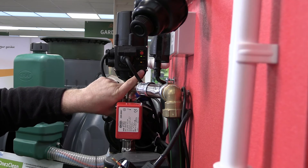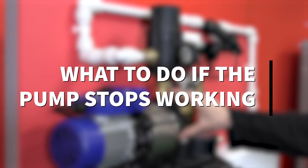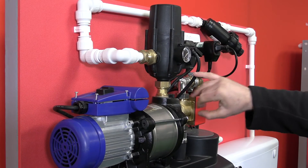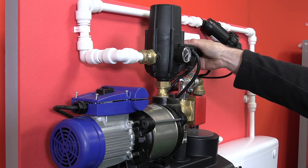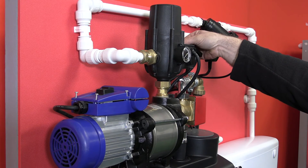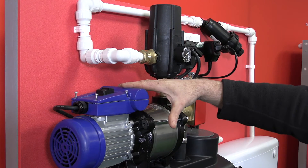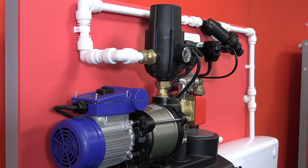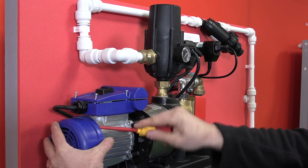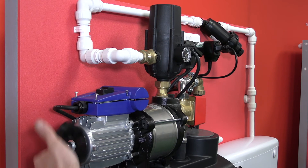Once the toilets are filled, pressure has built up, and no flow of water is detected, we'll see the amber light go off and just the green light remain. If we find we haven't got water in the toilets and can't flush them, and we come to the unit to find pressure is down at zero with a red failure light on the Control-Matic LEDs, the first thing to do is press the reset button. If the pump just makes a buzzing noise, the most likely issue is a failing capacitor. First thing to check is to take this cover off to expose the fan and make sure it turns freely and the motor isn't stuck.